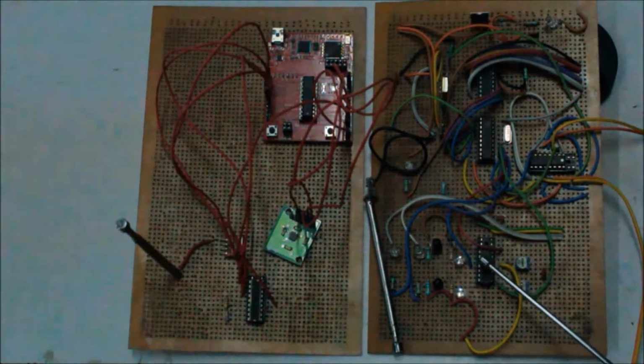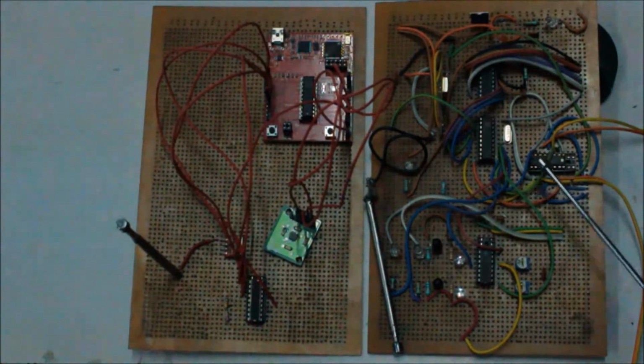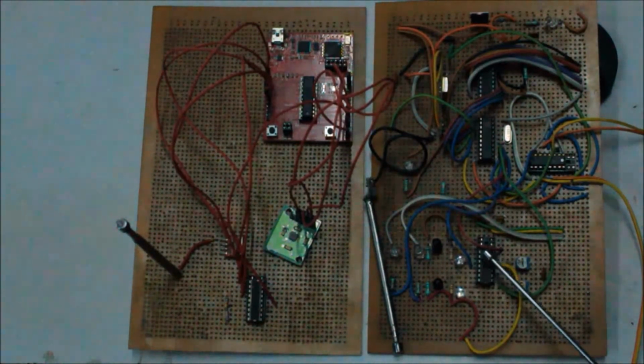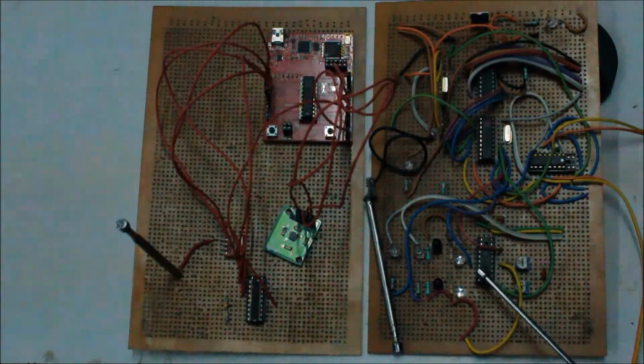Also, we have used a motor driver IC L293D, which is capable of driving 200 RPM motors at the same time. It is again manufactured by Texas Instruments only. Also, we have used the LM324 IC manufactured by Texas Instruments for the purpose of obstacle detection and perception. And due to this functioning of the IC, we call our project a dual mode robot.